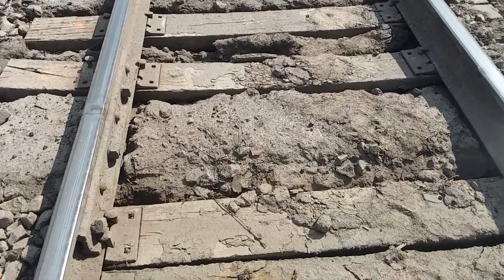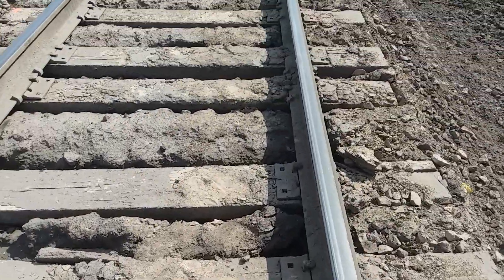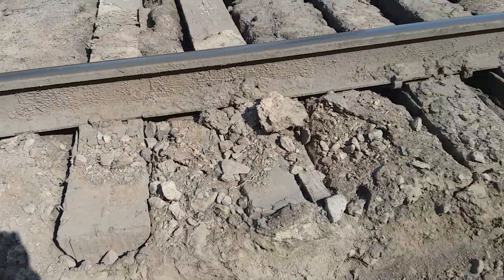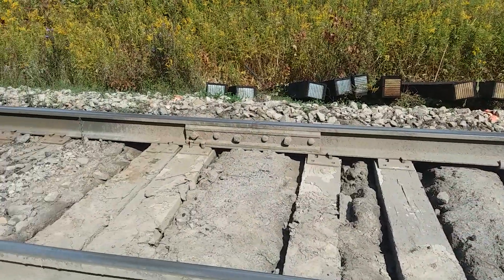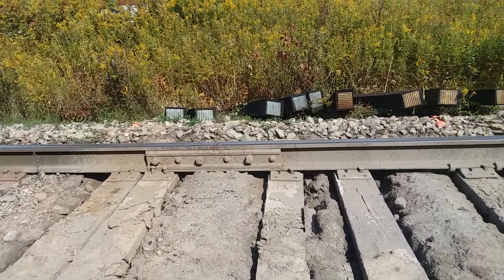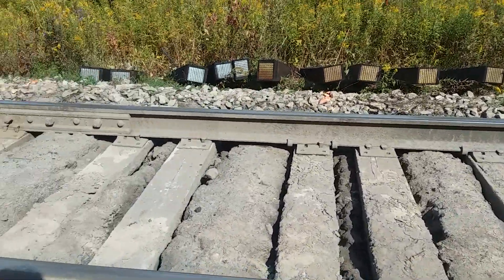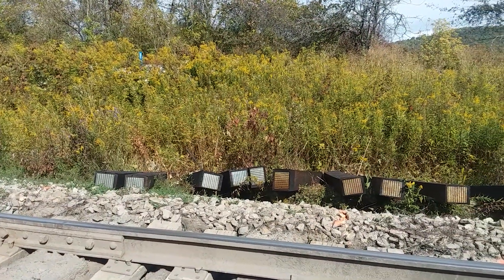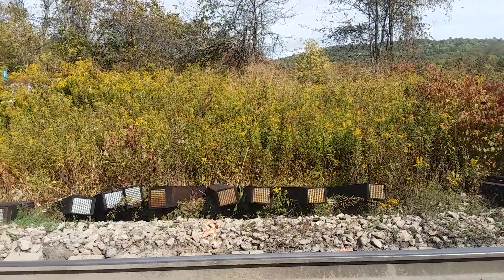You can see all the mud in here — it's just a mess. Obviously when it rains it doesn't hold track surface very well, so I'll dig all this stuff out and a bunch of new ties have got to go in here. You get the mud and it gets wet, the track wants to pump up and down, then it starts loosening your spikes up and wearing the bottom of the ties out. A couple of those ties are only about 3 or 4 inches thick. The new ties are 9 inches wide, 7 inches thick, and 8 and a half feet long.